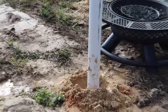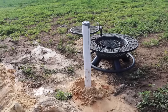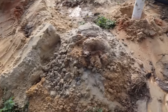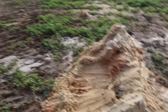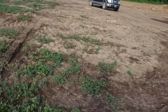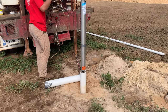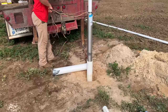Here's a look at the well - they're going to put the pump down today. The first 45 feet they went down was all sand, and then right at 45 feet they hit 50 feet of clay - he said that would have been prime stuff for the pond but unfortunately it was 45 feet down. Today we're going to hook up the pump and run the power cables - we've got a temporary power pole set up, so we're digging a little underground trench to get power to it. The five horsepower pump is just a long cylinder shape - they'll drop it down inside the casing about 100 feet with the power cables already connected.